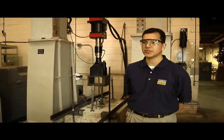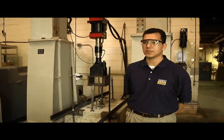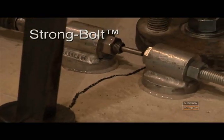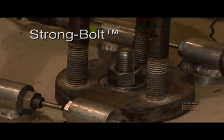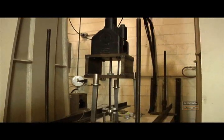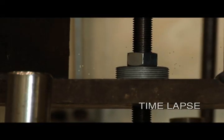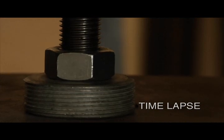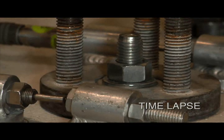This is our seismic tension test equipment. We use this test to subject an anchor to a cyclical load meant to simulate a seismic event. We're going to be running the test in a crack. We have the anchor attached to our seismic actuator here, which produces the up and down cyclical motion to simulate an earthquake. We also have instrumentation going across the crack to monitor the crack width as the test is conducted.